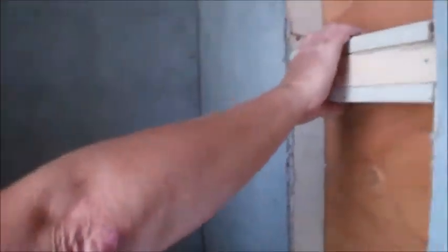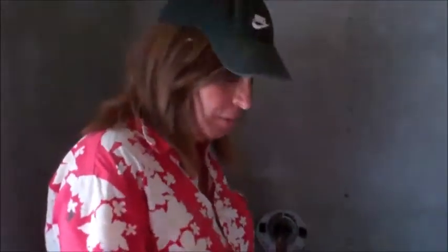Here's a wrap-up for the Cool Life channel. We pretty much got our wet walls in here, our shower pretty much done. We got the niches ready to go — put a piece across here tomorrow and finish that off. We're going to put some inside pieces in, backer in there, and then do all the seaming. On the downside, I was hammering so hard I loosened and cracked some mortar over there, so I've got to get some mortar tomorrow to infill that and smooth it again.